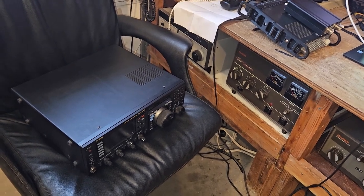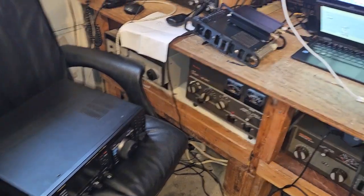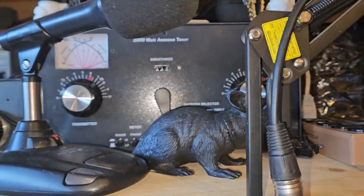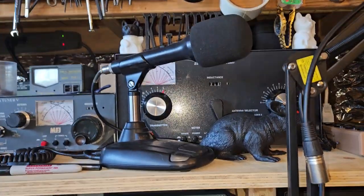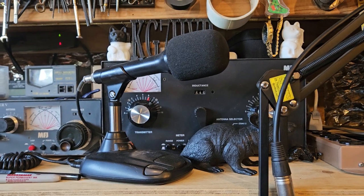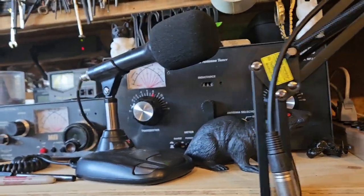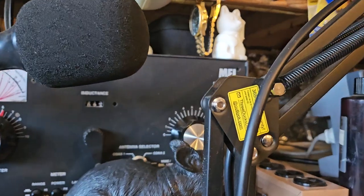I haven't really used this radio much. This is the one that I bought along with that tuner, the 9882. I tried it briefly and found that the meter was really odd, so I opened it up and checked everything. I found a cold solder joint on the balance line output. I fixed it, but anyway — I wasn't using the balance line, so that wasn't really an issue, which doesn't really work well.